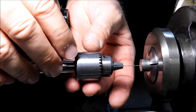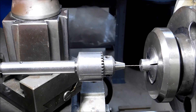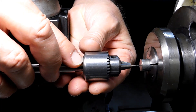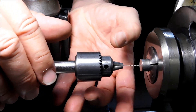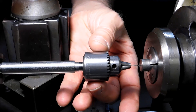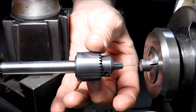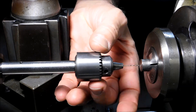Okay, that is real time. You can see the difference between the projection here — that's about a solid three quarters of an inch. The drill is flush with the face of the part. And that is just under a half — I would say that's a solid quarter of an inch worth of depth. That was real time. I did not use the crank on the tailstock. I drove that in by hand. If the drill were to start to grab, you could actually let it go and let it spin with the material and back it out with the helix of the flute to reduce the risk of snapping it off.